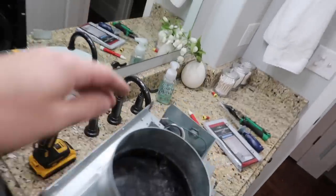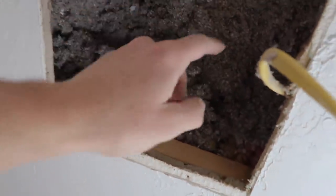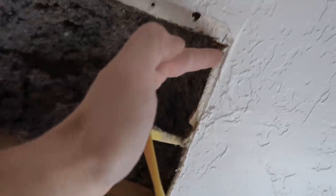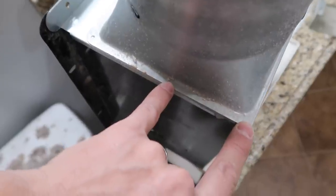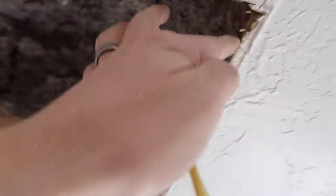Wiring is all the way undone. The new fan is unboxed and ready to go, all set up to be wired in. I did a dry fit to see if it would fit up in — it does fit, but when it tries to pivot it's bumping along this little bit of line right here. This fan is about two and a half inches taller, so I have to account for this swing room. I'm going to take off just a little bit of this sheetrock. I recommend using a keyhole saw instead of a razor blade because with a razor blade you'll have a lot of momentum and end up gashing the ceiling. With the saw, you just kind of slightly saw at it — it does make more of a dusty mess, but you'll end up with a cleaner and more exact cut.